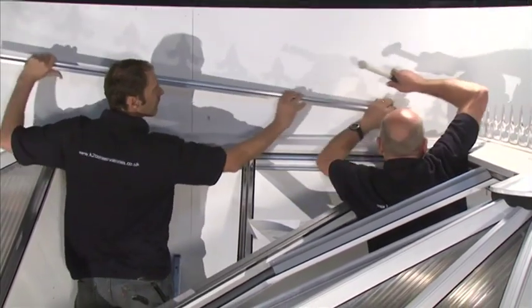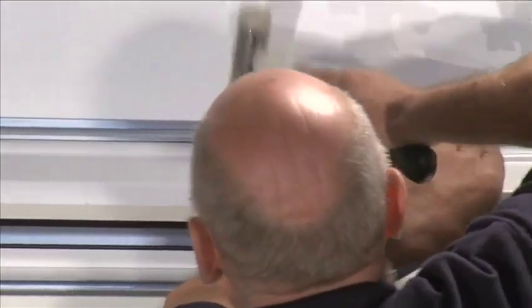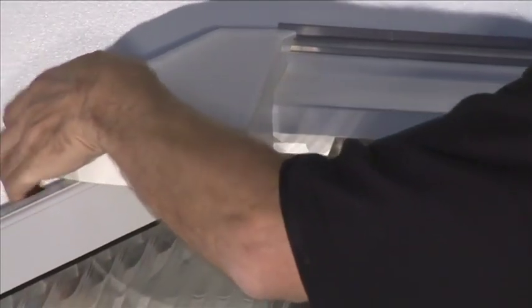For further detailed instructions on the wall plate capping assembly, please refer to the installation guide. Apply a bead of silicone around the edge of the quarter boss cover cap and attach to the end of the wall plate capping assembly.